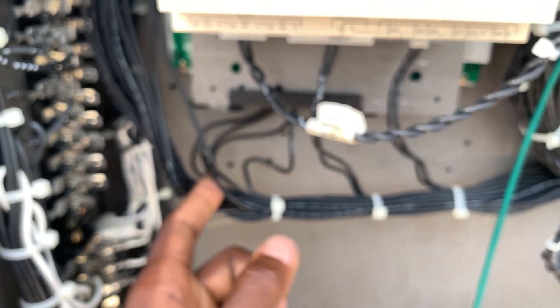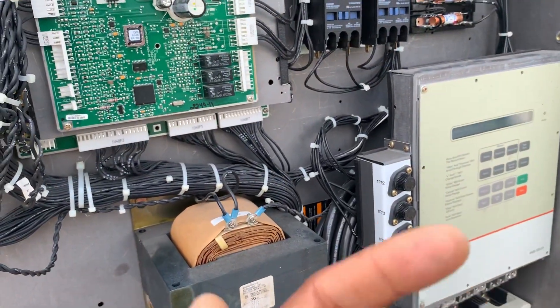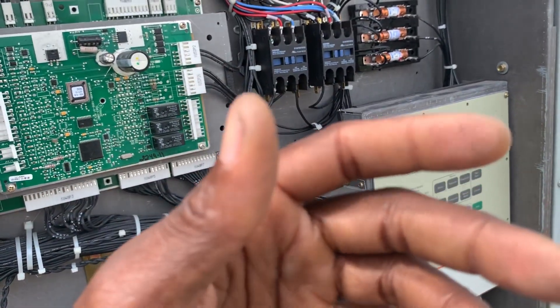One of these wires to ground is 2.8 volts; the other wire is actually just ground, or negative DC. So it sends out 2.8 volts DC for the sensor, and as the resistance goes up, the amperage draw goes down.